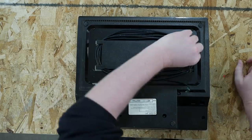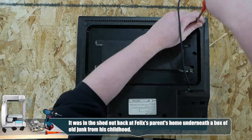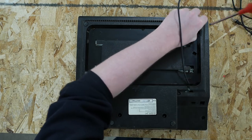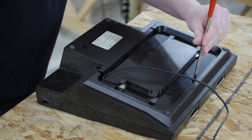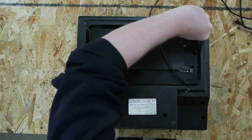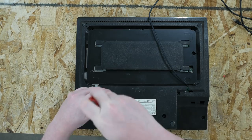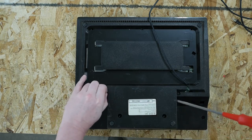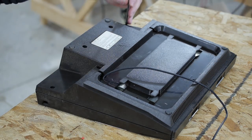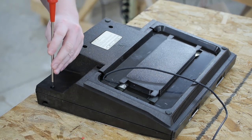This one looks like it actually did come from the floor of a barn, so there could be a lot of corrosion inside. The first version had a breakout box that would supply power to the console — the RF signal was hidden in the power signal and sent back to the box, then into your television. Angry Video Game Nerd has a video explaining it in detail. I'm intimately familiar with the Atari 8-bit computers because that was my first computer. I'm expecting to see a 6502-based game system — the MOS Technology 6502. The old 2600 used a 6507, which is just a 6502 with a reduced pin count to save money.